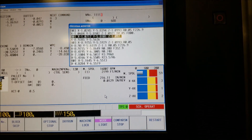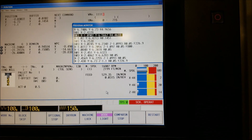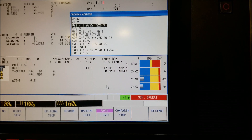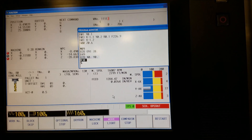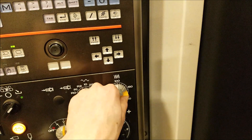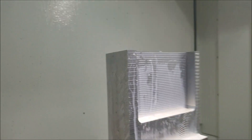We're getting close to where I want to max out. 530 inches per minute. 10 more. Finish pass. Let's see what it looks like. Didn't sound horrible. 160% — over 500 inches a minute with a half-inch tool. Doesn't look too bad. Core finish, a little stepped. Let's go take a look at the chips.